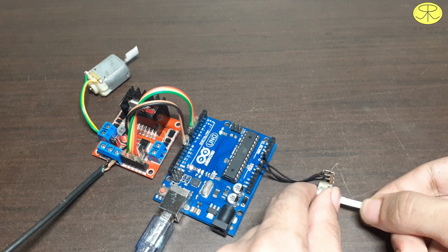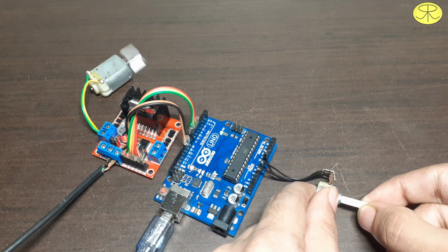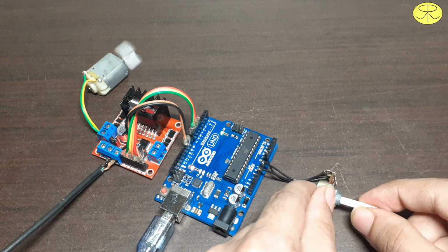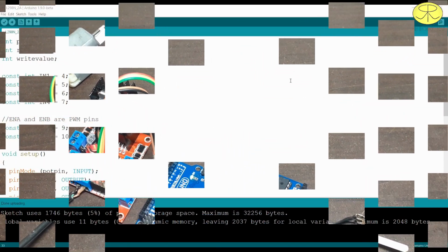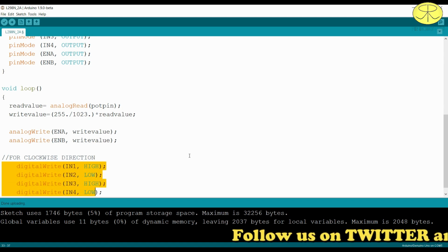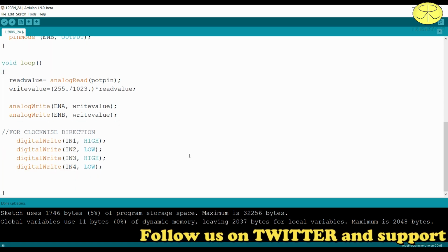We are able to control the speed of the DC motor with the help of this potentiometer. The motor was working in the clockwise direction, but if you want to change the direction of the motor, you just need to uncomment the lines below the anti-clockwise direction line. The link to this code is in the description below.